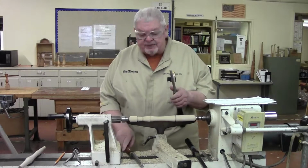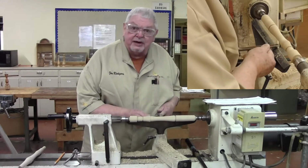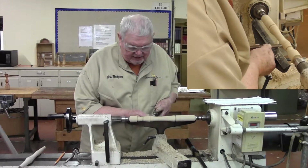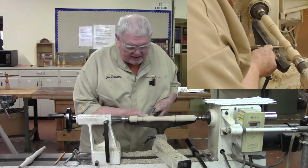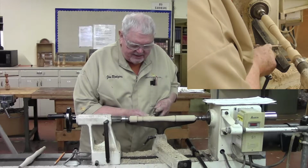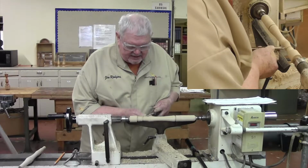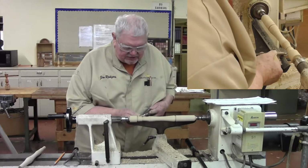And I'm going to go back to the spindle, the shallow fluted gouge, almost said it, because it's a smaller area of cut, and that might also help improve the surface quality. And I can tell right now that it has. Same thing on this side.